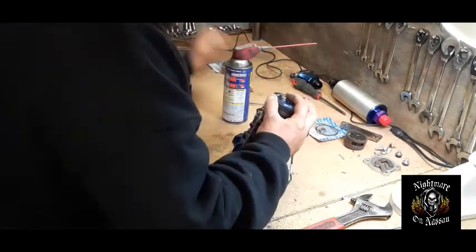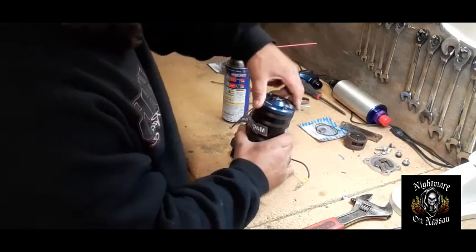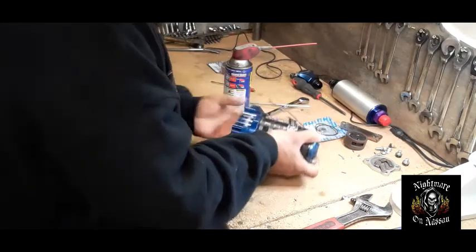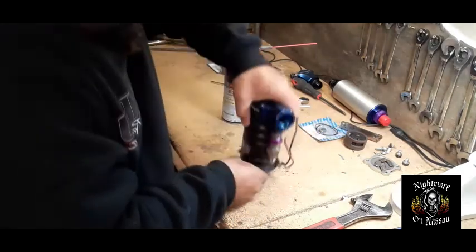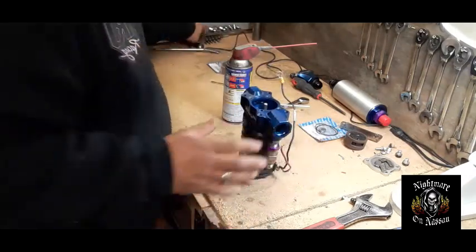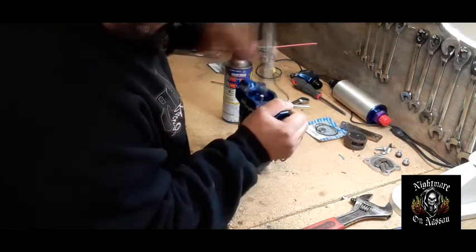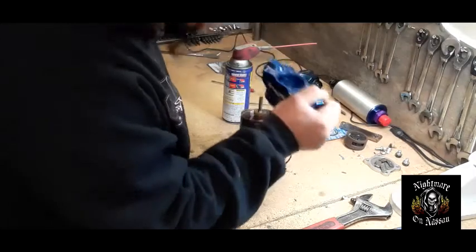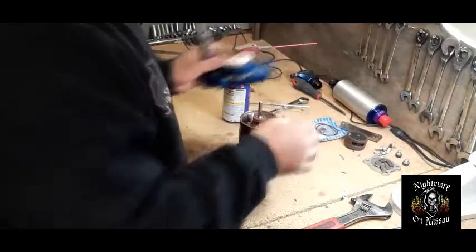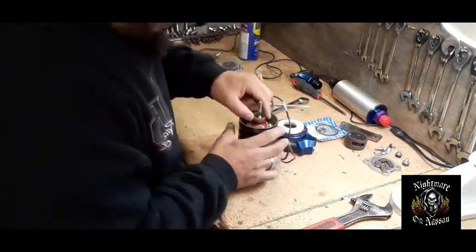Let's put the brushes back into place. With a small hammer I'm going to try to lift this up and bang it out — and it came out. So we're going to put this here. I actually did not end up using the WD-40 — I figured it would come out. Here is the bearing, and the bearing has got some rust on it. How water got in here — it must have been condensation from this thing sitting in a garage for as long as it did, until I purchased it.